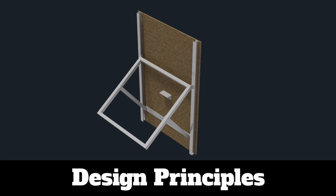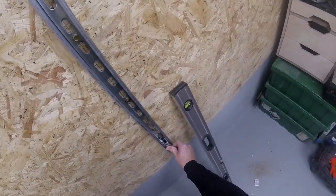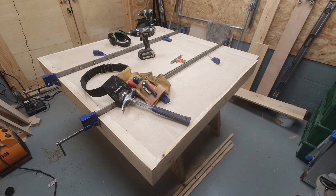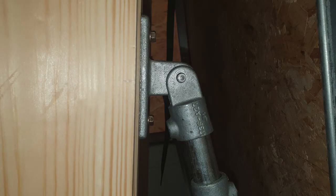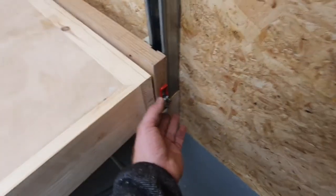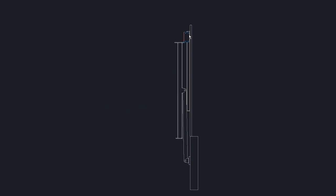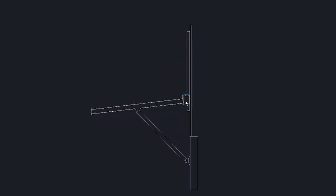The principles of the design are as follows. You will need a wall mounted linear bearing, preferably one that prevents lateral movement. A solid rigid reinforced worktop. A support strut mounted in the centre of the table with a minimum of a 45 degree angle. A method of hinging the table to the struts and to the wall. A method of locking the table in place. And setting the correct geometry to make sure the whole thing is balanced and works.